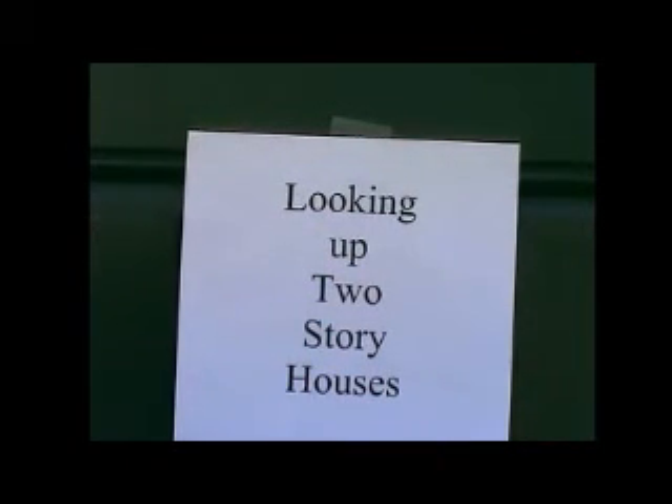Two-story houses have the same vulnerability as one-story houses, but in two-story houses you have the added vulnerability of the cavity between the floors. Any penetration, any venting, or any pipes that go through there you need to seal around. We've got the floor cavity and the siding. The bees found a hole. This gentleman called with bees getting into this vent terminal on the side of the wall. The terminals go through the first and second story, and the cavity is the floor space.